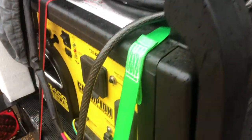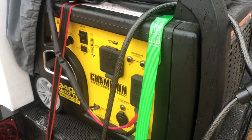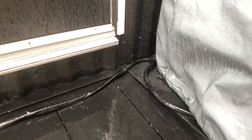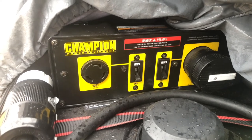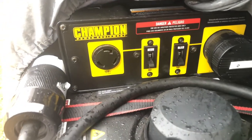Now let's go outside and check out the generators. We went with Champion 3400-watt inverter generators — this model takes gas only, though they have a propane model as well. We have two of them. Our fabricator built a platform to level them out because we have a two-foot dovetail on the back of the trailer. The generators run to a parallel kit, which doubles the wattage to about 6,800 watts total. I flip the 50-amp breaker on after starting the generators, plug it in, and we're good to go.